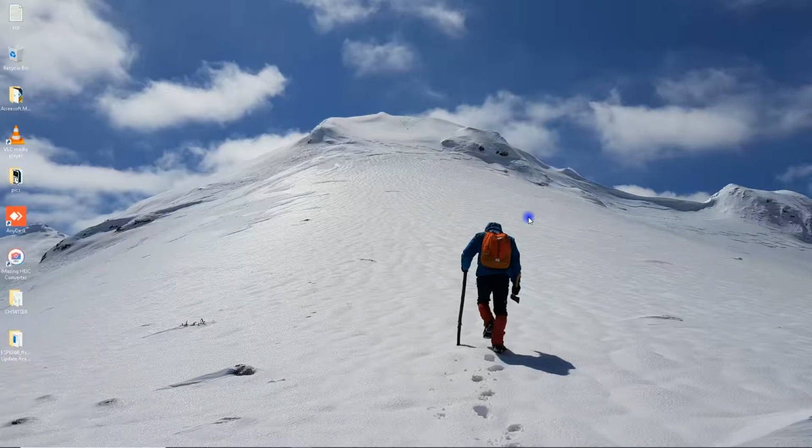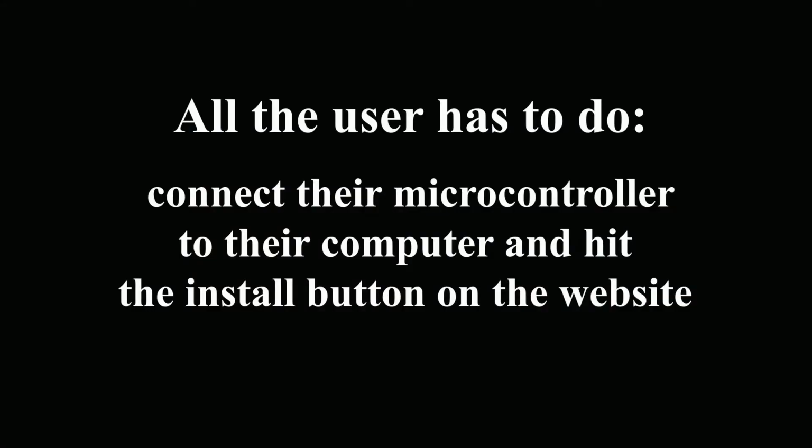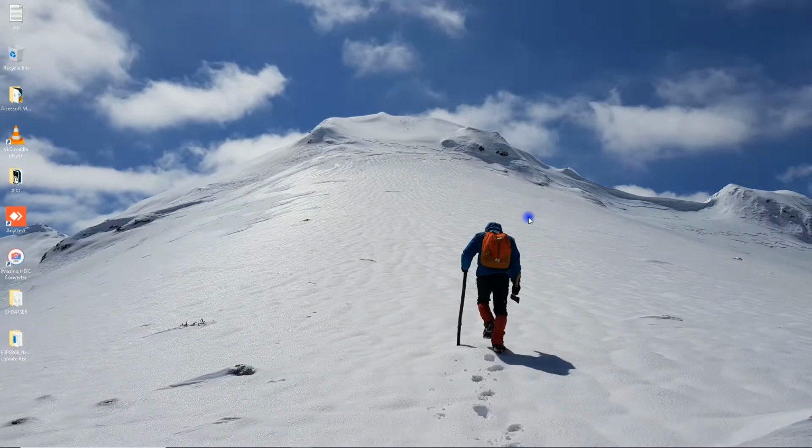So to install ESPHome firmware on your ESP8266 or ESP32, all you have to do is navigate to the ESP Web Tools page. Connect the microcontroller to the computer and hit the install button on the website. The tool will automatically select the right build for your controller and install it. In the description you can find the link of the ESP Web Tools page.